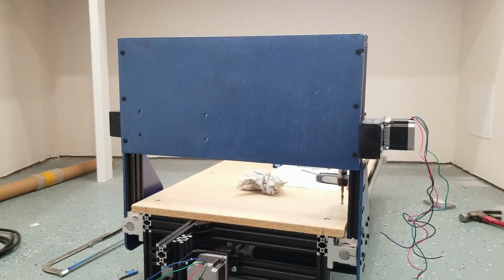The main thing we are looking at here is a disregard for the fact that all electronics for precision robotics, I don't care what size the robot is, if you're expecting it to be accurate, it should be assembled correctly. And this is mandatory. That means that all electronics, as far as the controller itself, any component should be installed in a metal electronics enclosure. Once again, the metal enclosure will act as a proper Faraday cage, protecting from a certain amount of EMI. Also, it protects from the environment that your robot is installed in.